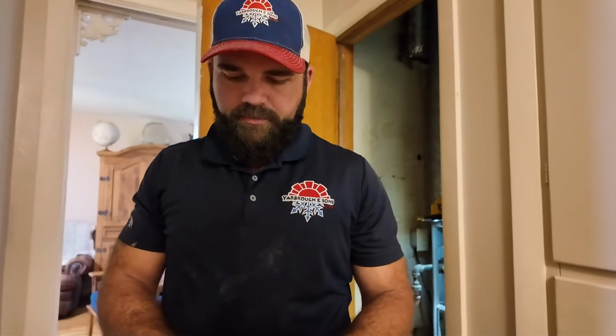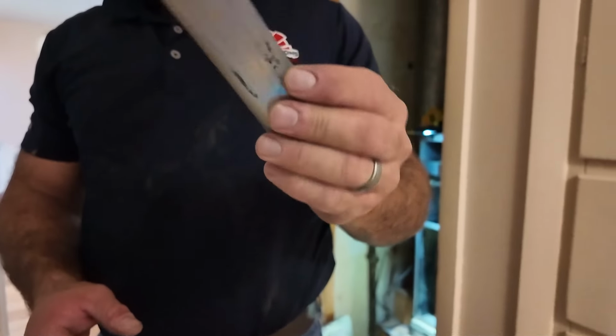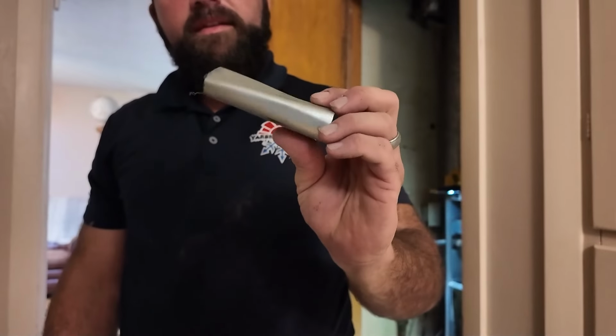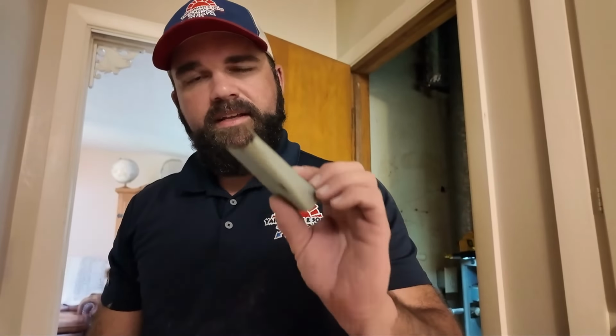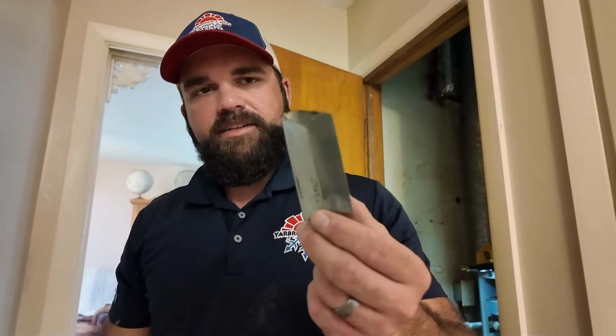All right, so upon putting this blower back together, we had previously already pulled out one piece of folded metal, thought we were all clear. Went to test the blower quickly, and I was a little suspicious, so I kept my hand right next to the pigtail to unplug it, and sure enough, about a second of runtime, I hear a big thud, a tink sound, and another piece of metal had fallen out from the heat exchanger. So now I really need to dive in deep and figure out why somebody had been wedging these pieces of metal in the heat exchanger.